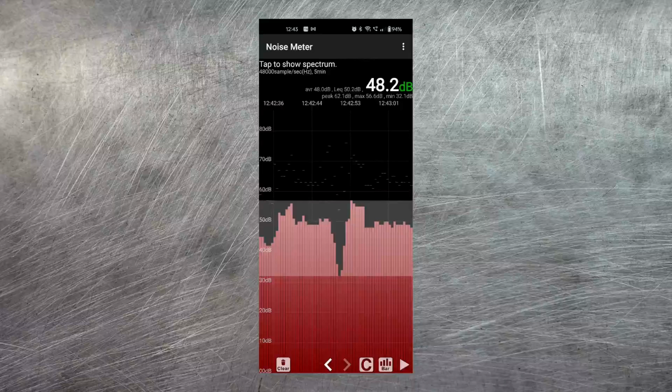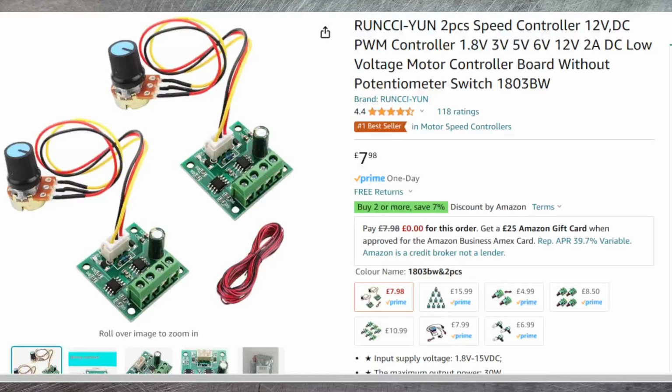And what you can do here is buy something like this, where you could attach the power connector that is driving all three of the fans into this, and then you could use the control to slow the fans down, and that would quieten things down quite dramatically. Now, I haven't bothered to do that here because I've got the NAS kind of tucked away somewhere, so it's not really bothering me. But if you did have it close to you, then I would recommend picking up something like this. They're not very expensive and can make a tremendous difference to the amount of noise that's generated.